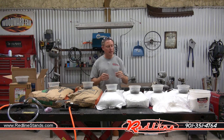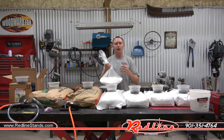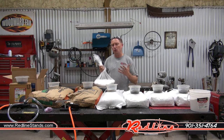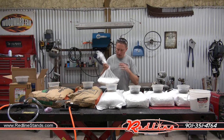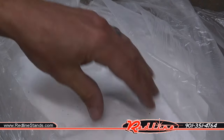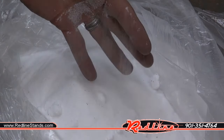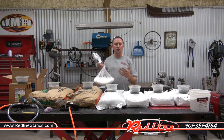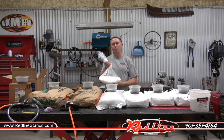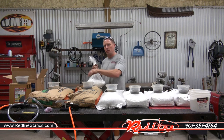I do want to say that I'm going to take soda out of the equation here. I've got other videos where I'm demonstrating soda and showing you how it works, but if you have a look at this stuff up close here, you'll notice that this stuff is more like powder than it is sand or any type of an abrasive. It's not good for removing, you know, rust, powder coating. So I'm not going to be using soda in this video, comparing them against all of these abrasives.